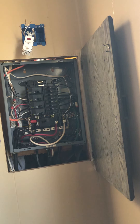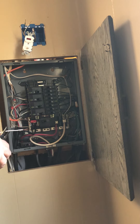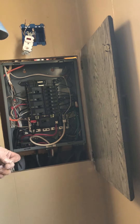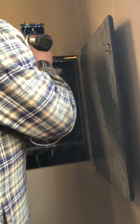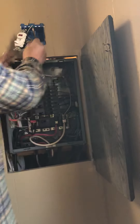Alright, so here we go. Right now I'm making a jumper wire for my neutrals because I don't want to sister them up. I don't want to double the neutrals up on the same screw on the switch, because that's a surefire way to have one of them come loose and then you don't have a neutral anymore.